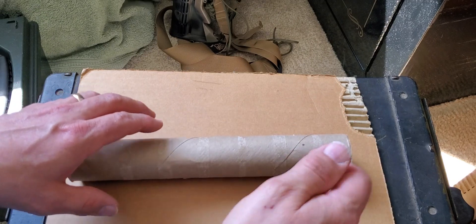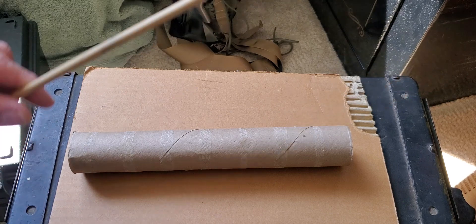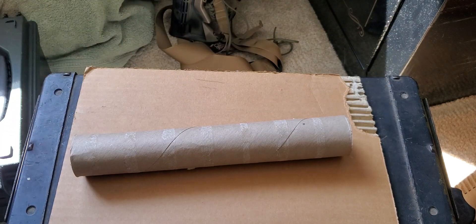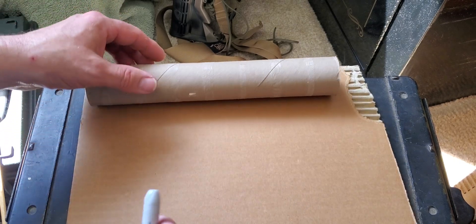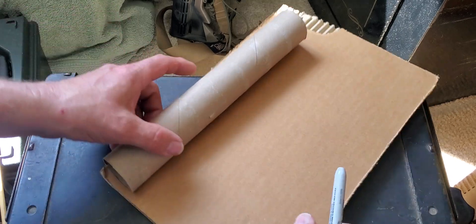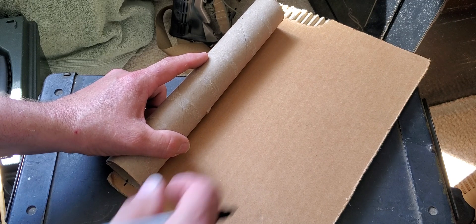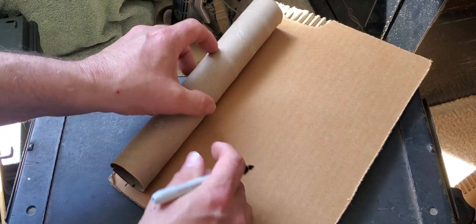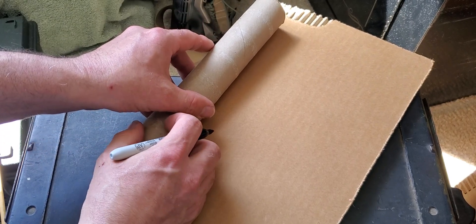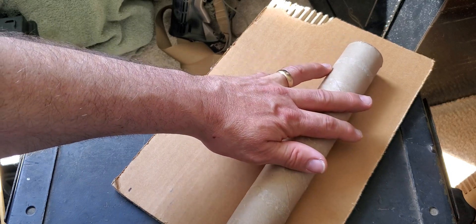The other thing we need is a metal steel rod. So we would calculate our twist rate - one turn in 10 inches. We would take this here and mark on the end, mark it here and here. And we roll it, roll it until it comes out. So it starts here, we have a mark, we roll this - and there's our one turn.